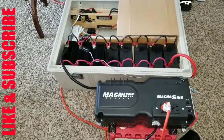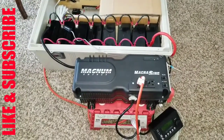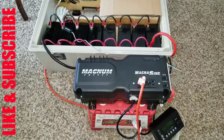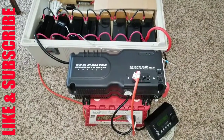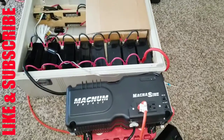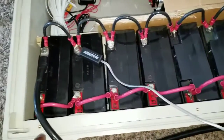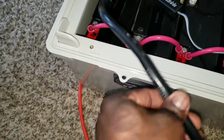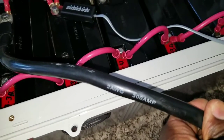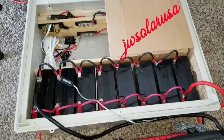This has been my dream for the longest time for these projects — my portable generator kit. You can see the batteries I have here. I've been doing tests with them. Those are eight 12-volt 22 amp-hour batteries, rated for 20 hours runtime. They were designed for UPS or jump-start use. They're all wired in parallel with number 2 gauge wire, rated for 300 amps and 300 volts DC.